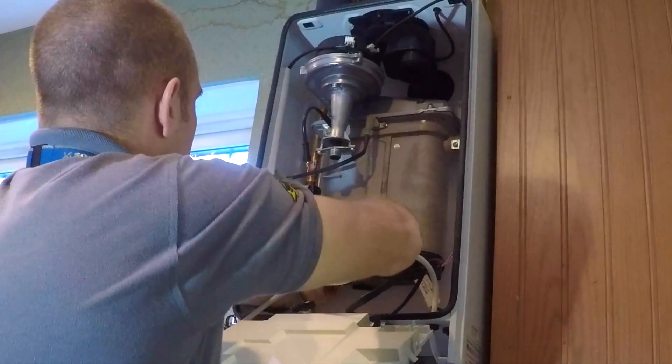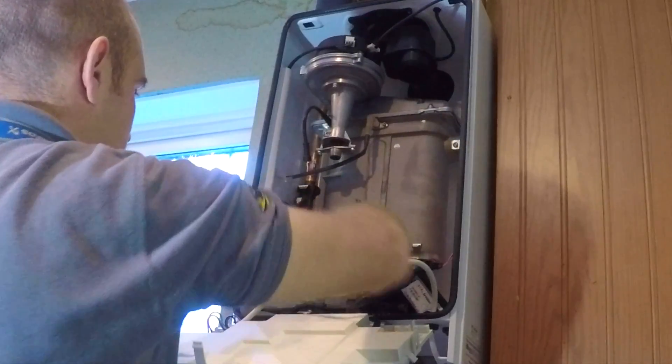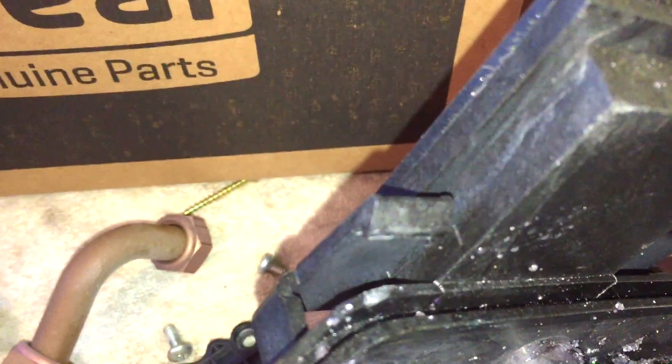You need to use a slight bit of brute force, and often wedging something behind the back of the heat exchanger to hold it off the back of the boiler gives you a little bit of extra room for the back brackets. With a little bit of brute force I forced it down — and one of the plastic lugs on the sump that we're changing broke off. There's the debris in the bottom of the sump, and there's the lug that broke. And watch the spider run away when I pick it up!